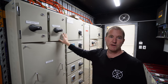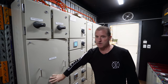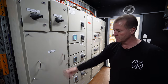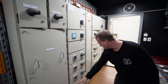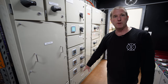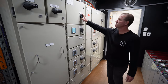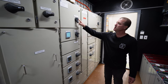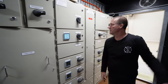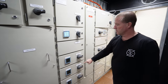So they're just spare phases that they can use as single phase feeds around the site. The cable management zone here is where we can bring all the cables in from all the different feeds and manage them from the ground. If you come through the bottom here, we've got seven cable entry points going out of the container into a big pit, and then they reticulate around the site. So here we've got a main switch, which is our three-phase main switch, and it's coming from the three grid-forming inverters over here, and then it's being made available to all of these different buildings around the site.